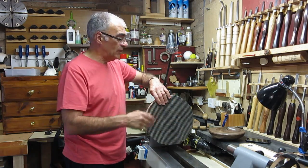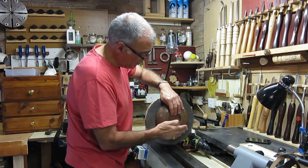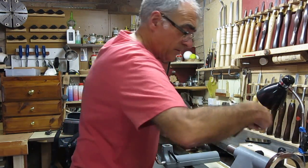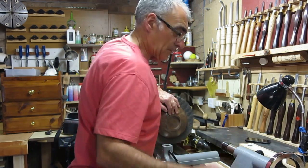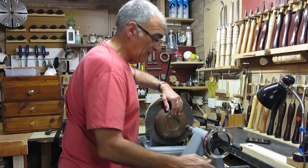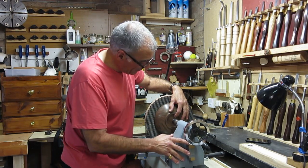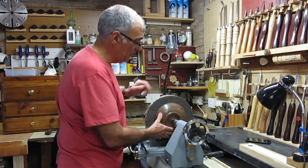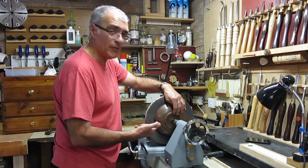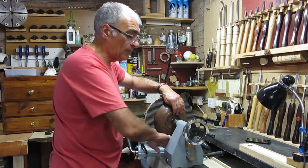And yes, I've got my jewellery on and everything, because I'm not doing any turning tonight, unfortunately. And then you can then place your bowl on there as suitable. You can tell this has been well planned, can't you? Anyway, bear with me. Bring up your tailstock. I don't actually want to put it in contact with the bowl now. Bring up the tailstock and then apply sufficient pressure and you have a friction fit. So then light cuts would then enable you to remove the foot to the desired design and depth that you require. So that is the other method.